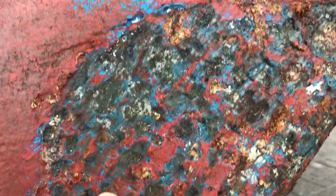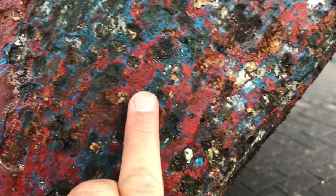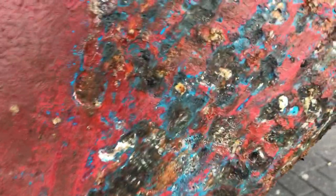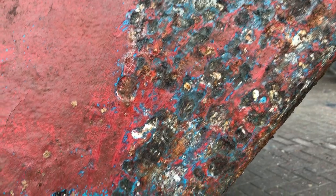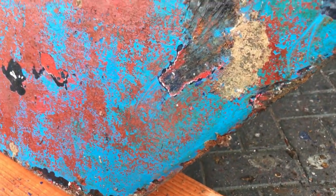Apart from what I've just described, we're looking at general pitting. As you can see here, where the anti-foul — this red paint — has been worn or scraped away, we've got some reasonable pitting where the protective paint has disappeared and corrosion is starting to appear. That's not great. What we need to do is take that back to nice clean bare metal, then prime and paint it again to prevent it getting any worse. It's not the end of the road — it just means the nice flat shape of the keel is compromised slightly and might affect her speed.